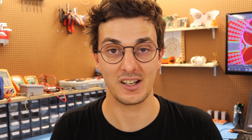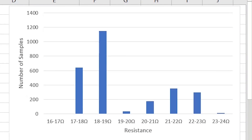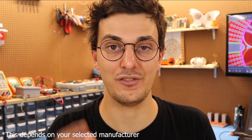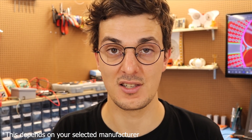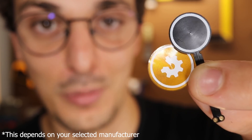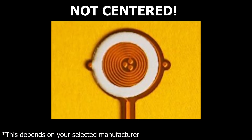When it comes to manufacturing, you also need to be aware of some hiccups. With my PCB coils, I found a problem with the repeatability of the etching process, which varies the track resistance — so this might be less accurate than manufacturing an FR4 PCB with specific standards. Over the years I also noticed defects with silkscreen quality. There's an actual difference between the silkscreen of black and yellow solder mask: the yellow cover layer silkscreen is completely solid but is applied by hand, which means it can be offset.